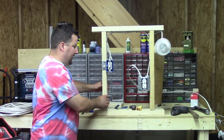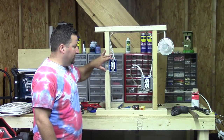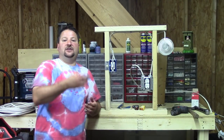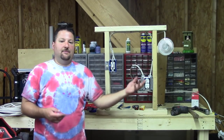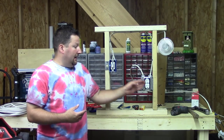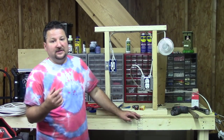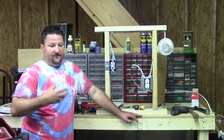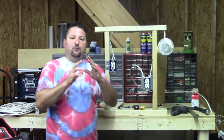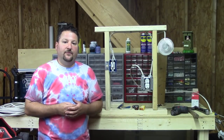Anyways, here we go — we've got our light, our box with our outlet, and our switch. Everything that's metal has been grounded and everything is tied back. The key to anything is a good foundation. Everything was done right here, but what we were feeding in was bad — so that makes everything bad. When my work showed up bad, the first thing I did was go right to the source of where my work stopped to see what was feeding me. That's the number one thing in electrical: do stuff in steps. If something isn't working right, try and cut that circuit in half, or go back to the beginning. Work your way out from the panel — that's how you troubleshoot.